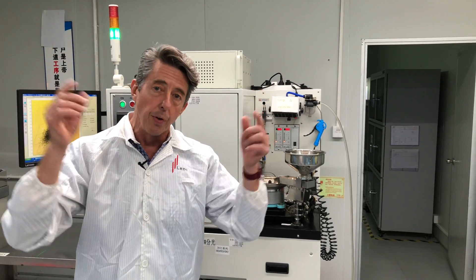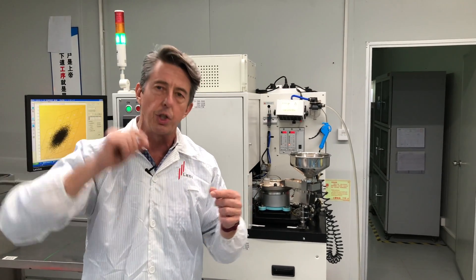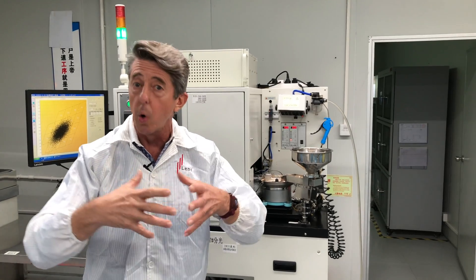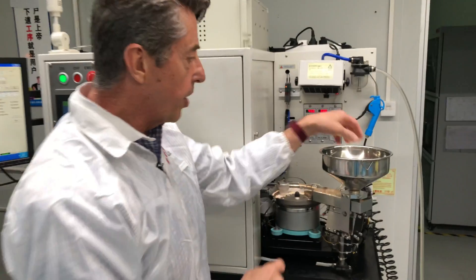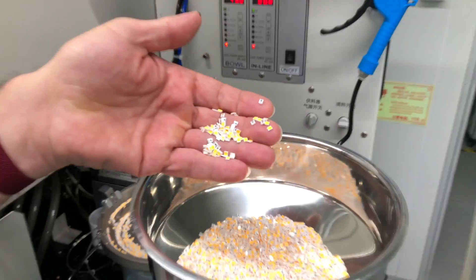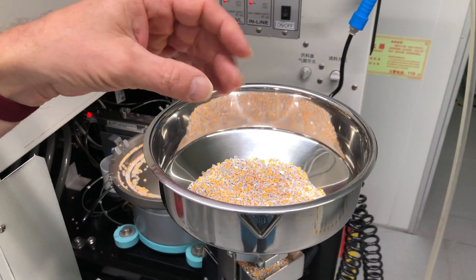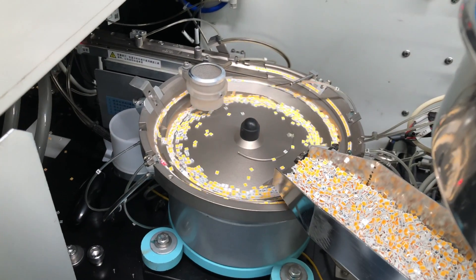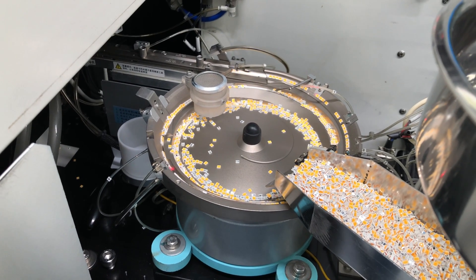When you're lighting up a cove with a linear product against a white ceiling, if you have an LED that doesn't have perfect color, it will immediately show itself. The machine behind me is sorting all the LEDs according to the shades of white. The LEDs are loaded in here — after the phosphor has been baked on, they're broken out of the LED tray and placed in here. They go into the roulette wheel, where it spins and lines them up so they can be lit up inside the machine.